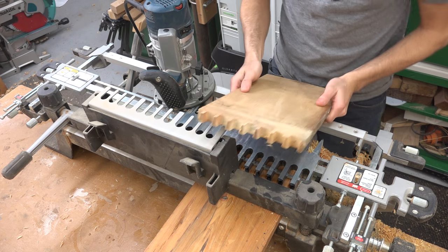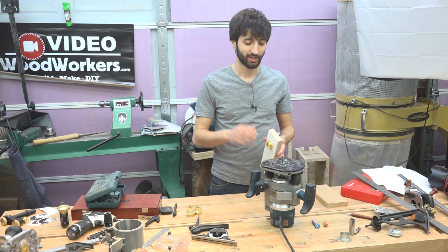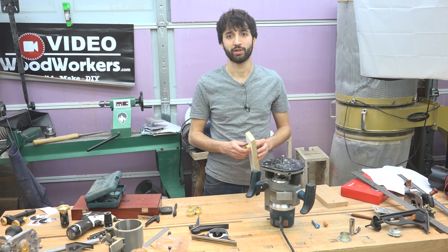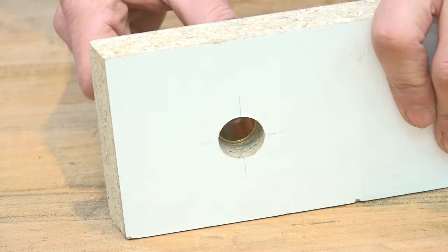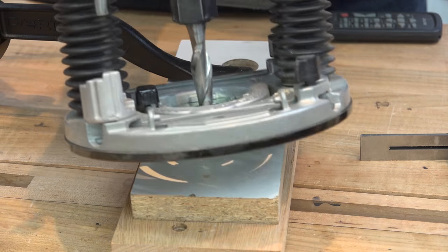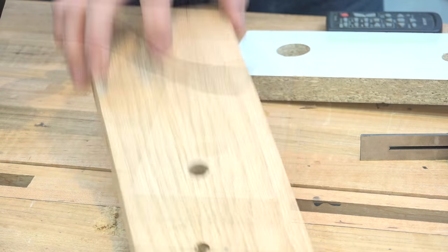Let's look at a few examples of using guide bushings in your shop. The first is how to drill a hole with your router. Here I have a half inch spiral bit with a three quarter inch outer diameter guide bushing, and all I'm using is this little block of wood as a guide. A three quarter inch hole in the block with a three quarter inch guide bushing means that when the guide bushing goes into the block, the router cannot move — so you can plunge the router down and drill a hole with your spiral bit.